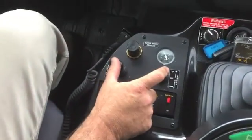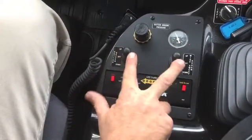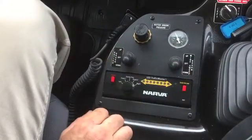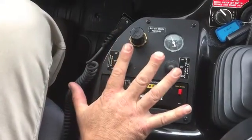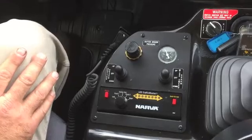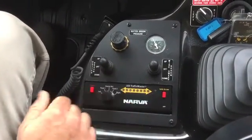I think this is a great broom cost saver. Over a 12-month period, the brooms you can go through is significant. Those two are a wide sweep channel brush. That's a standard setting. Now, if you've got something packed into the road, you can pull them down, one or the other, whatever you want. It'll give you the pressure onto the road to actually remove the stuck-on product. So that'd be great for construction sweeping or something like that. Really good for site cleaning, construction.